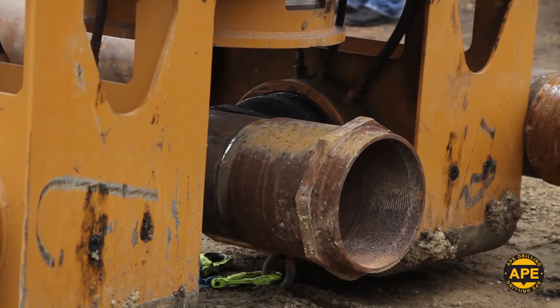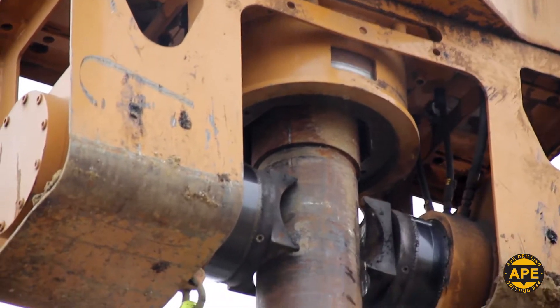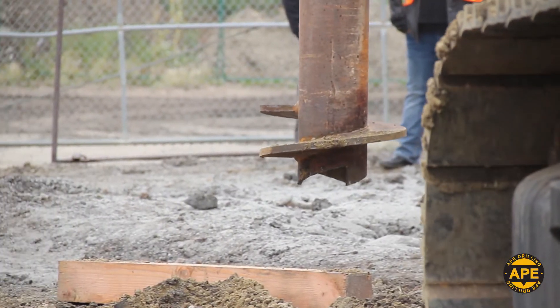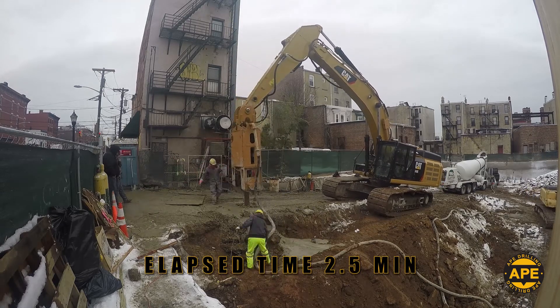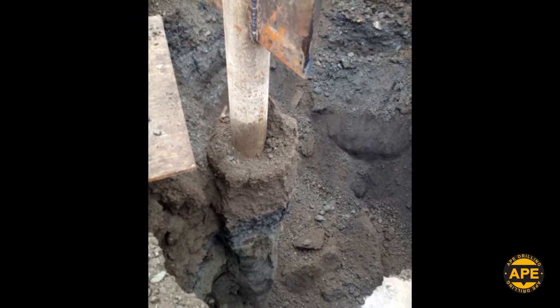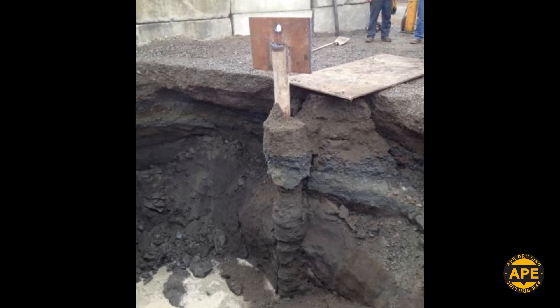The HD 150 safely and efficiently simplifies the grouting process by pushing grout directly through the hollow center of the driver and down to the pile's hollow tip during pile installation. This method creates a composite grout steel pile for the full depth, with superior lateral resistance if needed and the ability to control water and grout placement over the entire pile length.